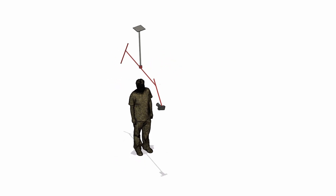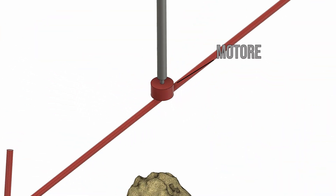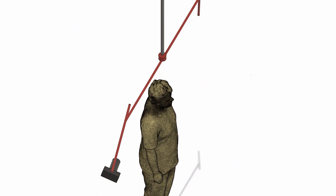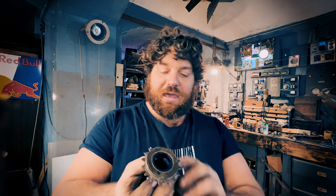This motor can work directly, but there is a problem: if I stop the motor — turn off the electricity — once the camera is spinning around me, the camera will have inertia. If I turn off the motor, this inertia will crash all the gears inside the motor, because the camera is quite far away and will create a lot of force and break all the gears inside.